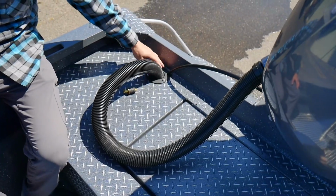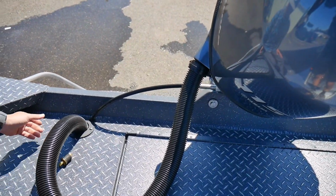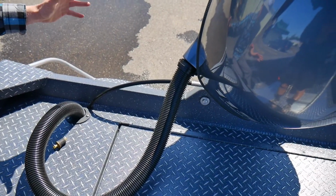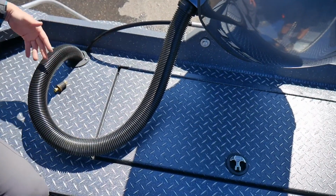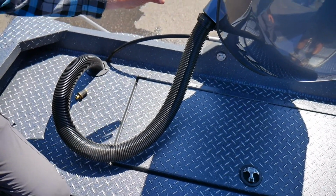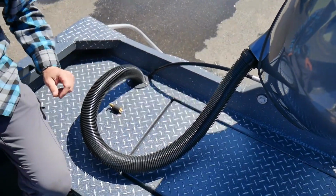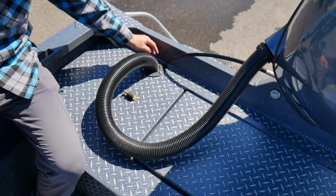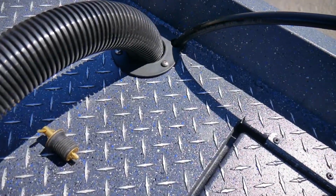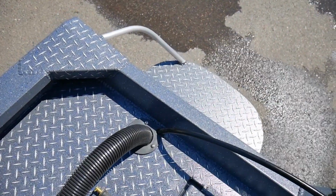Steering cable through the bulkhead here, right up into the motor, right into the pivot or the tilt tube. And then you've got your vacuum hose. Closes everything all off. It's tight, clean. Don't see anything. Look at this. This is ridiculously clean for an entire rigging for a motor, which has a NMEA network and everything. All of it goes through the tube. And then right here, where it goes through the bulkhead, boom, you've got it. Right on the deck, I'd say. You've got that nice clean TH Marine, makes it with the cable separate, but everything comes up together. Beautiful.